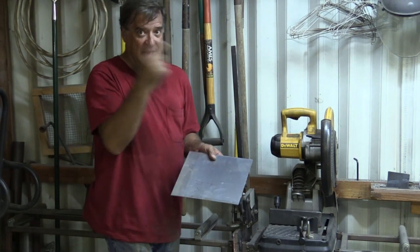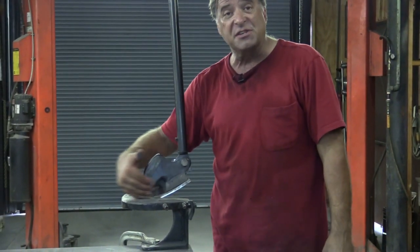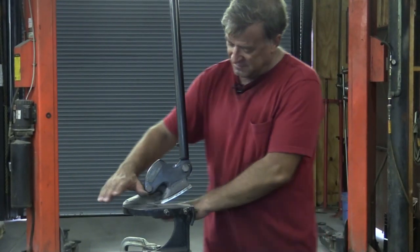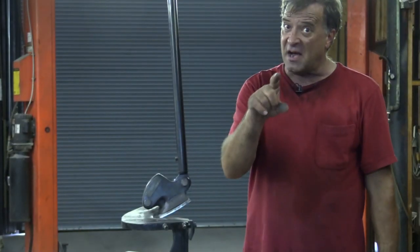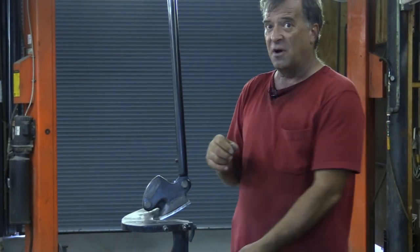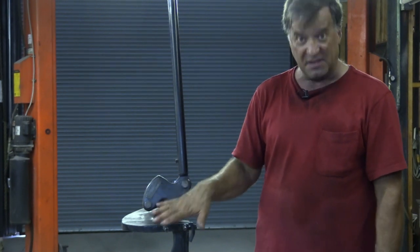So if you want to cut a curve, you can't use the plate shear — you've got to use a different machine. Where the plate shear had that brace, that throat, that big plate standing up that would keep your metal from turning as you cut a curve, this is called a throatless shear. There's nothing in the way right there, so this is what you would use to cut a curve. But don't try to cut heavy stock with it — like quarter inch by quarter inch or heavy rod — because this is a different kind of blade, more like a pair of scissors. Light, easy material only. Don't be cutting heavy stock on it or you'll chip that blade in a heartbeat. And again, they're expensive — you can't resharpen these, you simply throw them away and get a new set.